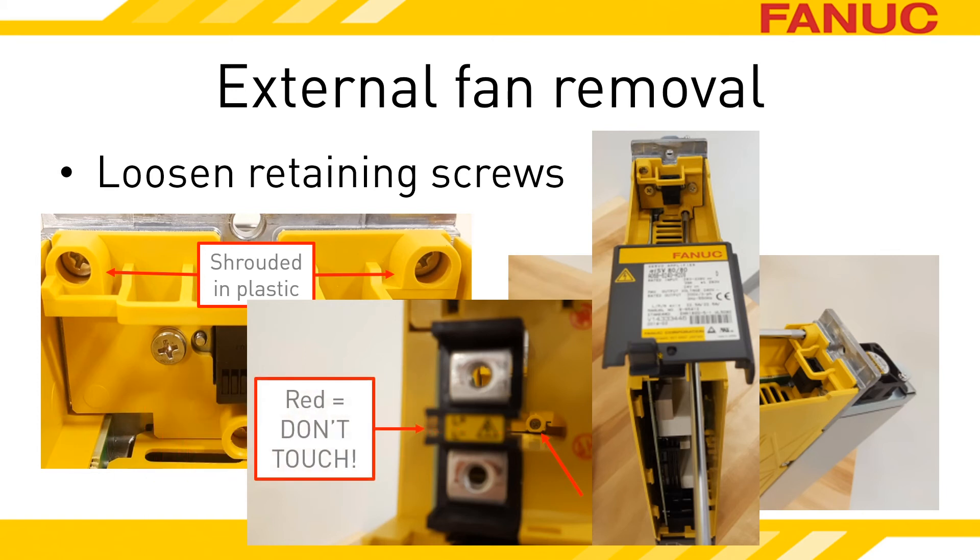It is now time for a tip on how to achieve a longer life. There is an LED between the bus bars. If that LED is lit, it means that there is voltage waiting to punish you for putting a metallic object next to the DC-Link bars. Please make sure the DC-Link is entirely discharged before trying to get the fan out.